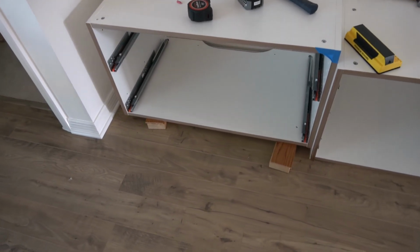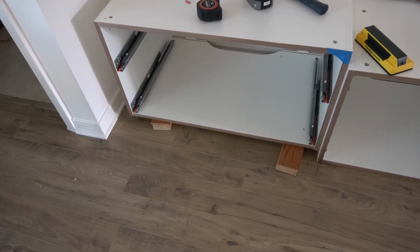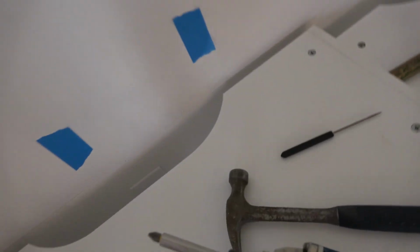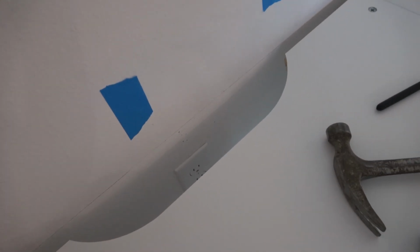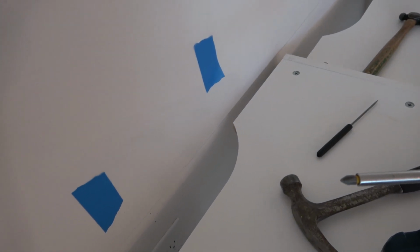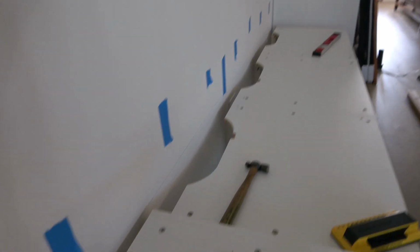So what I did, to make this easier on yourself rather than measuring, because floors can be wavy too, is I put my 2x4s underneath my cabinet to raise it up the height I wanted. And then I put the cabinet up, took the bracket and put it down here and pulled it up against as if it was hanging, and then I just ran a line across there. After I did that, I got out the level and made sure it was level going all the way down the wall, and that's the way it kind of works there.